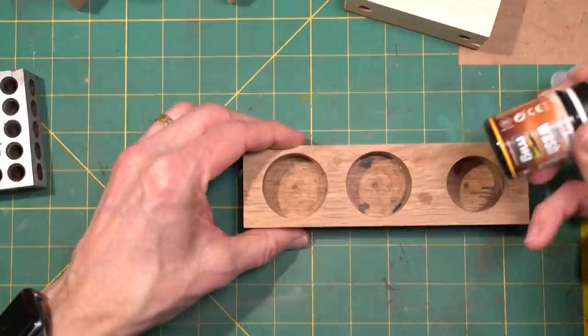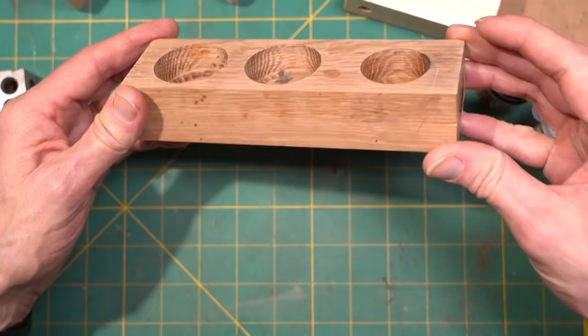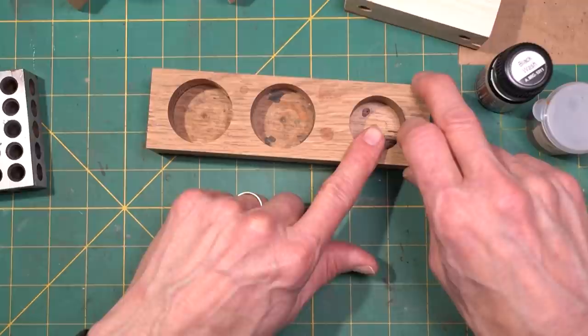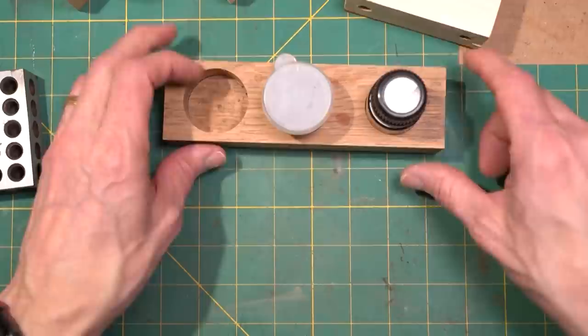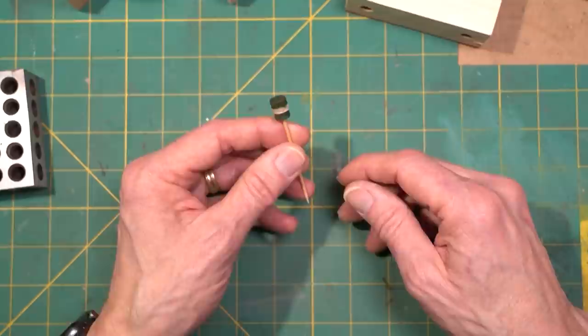This item is useful for holding paint also so it doesn't spill over. It's pretty easy to have something spill. So I went to my workshop, put together two pieces of wood so it was deeper and thicker, and then with Forstner bits drilled holes according to the sizes that I thought I'd use. So these washes fit perfectly there. These little bottles I use fit in there and I can hold up to three at a time, so as I work I'm not worried about them tipping over.